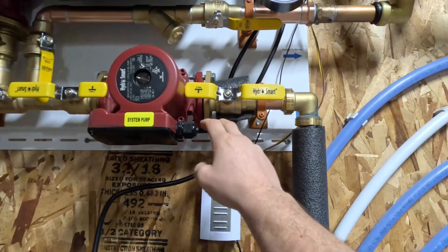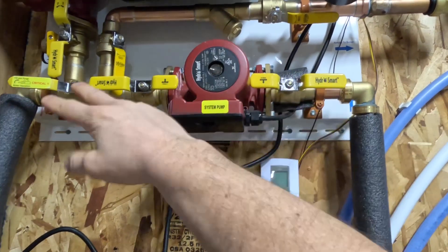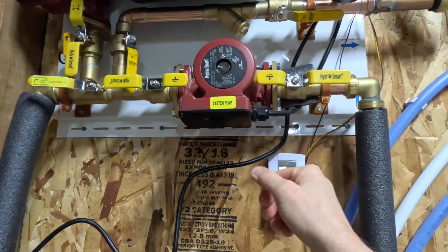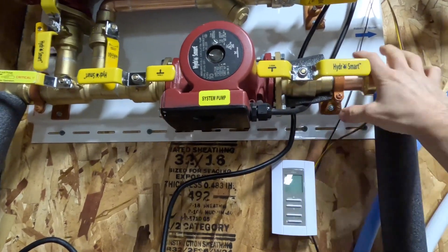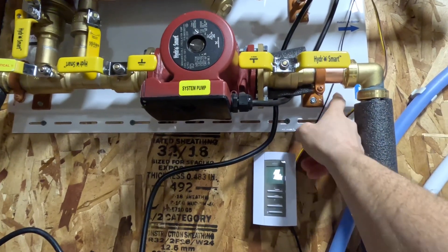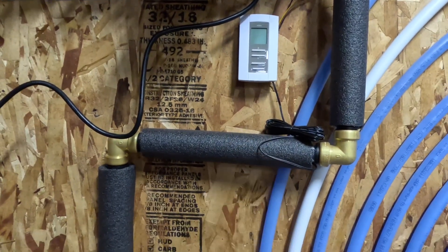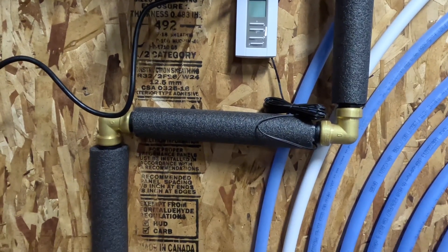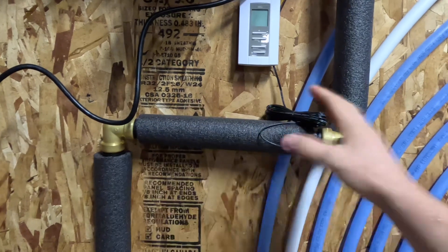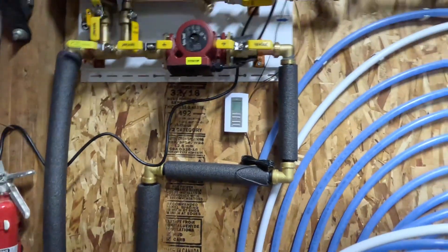I got to undo the electrical wiring to this pump, close off the valves, pull this pump out. I'm going to have to readjust where this hooks up, push it over, probably re-tap into here where this bracket is. I'm going to have to get a longer piece of PEX — which I have — extend it over and up.